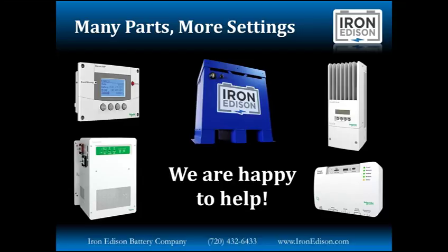One more question. Can the CommBox data be accessed without a wireless router or Android device? This gentleman has no internet connection and would prefer a hardwire method of data acquisition. The CommBox actually has an Ethernet port, an RJ45 plug on it. If you're good with IT and routing, you can give your laptop a static IP address, give a static IP to your CommBox, and just have a direct cable between your computer and the CommBox.